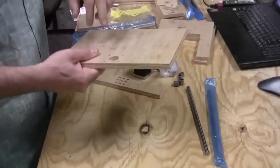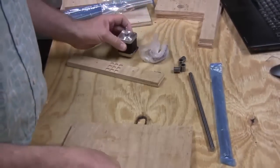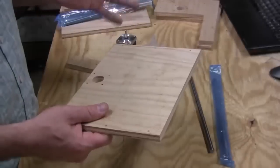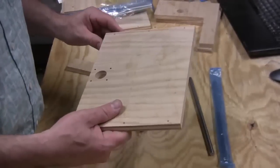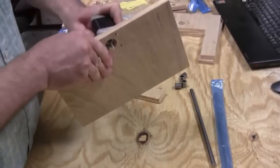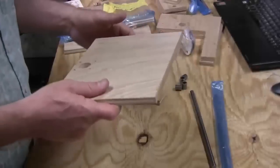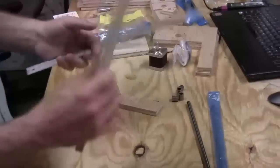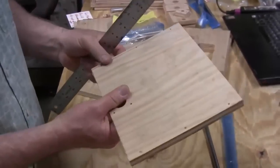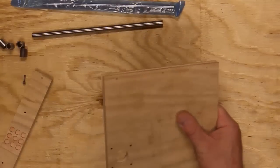You also have to check the exact size of this hole versus the size of the lip on the stepper motor. Depending on how you made your rear piece — whether cut on a CNC or laid out by hand on a table saw or band saw — you may need to sand it out a bit until you can just get that lip of the stepper motor in there. You also want to check that your sides are straight and that you have 90-degree corners. There's a little piece here that's a failure to cut through, so we'll be sanding that off before final assembly.